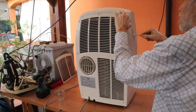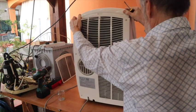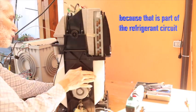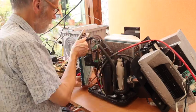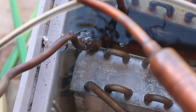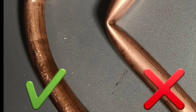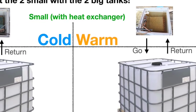The heat pump is from a mobile air conditioner. People tried to get rid of these large noisy devices as soon as the summer is over, and they experienced that these devices are not practical for all situations. You can get them typically for under 100 euros or dollars. They are also rather easy to convert into water-to-water heat pumps, if you accept that there is bending work to do with the copper pipes between compressor and heat exchangers — in this way you can place them into water tanks. During bending it is easy to force the connections where the pipes go into the heat exchangers, so that they will break. Then you will lose the refrigerant and your heat pump is broken. Moreover, during bending the pipes can fold and then the refrigerant will not pass anymore. This is the reason it is not easy to put the heat exchangers directly into the big water tanks without an intermediate water box.